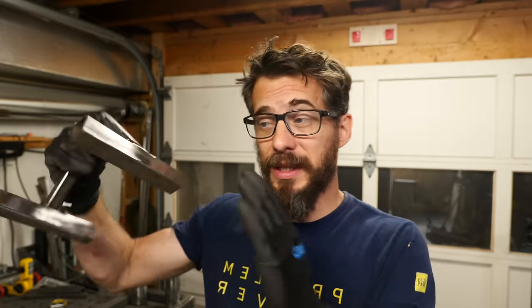Now it's time for finish. Ideally I would powder coat all of this stuff because it would be a really hard durable finish, but unfortunately my small powder coat oven is not big enough to hold the frame. In the interest of time I'm going to use an enamel paint on all this stuff because I've had really good luck with it lasting over time with a lot of abuse. If the metal pieces rubbing against each other eventually take the paint off, it's not a big deal — I can always come back, grind that away, and figure out a way to powder coat them in the future.